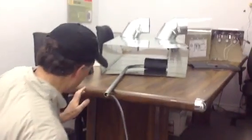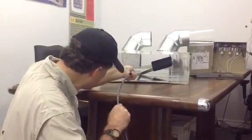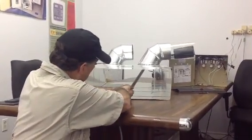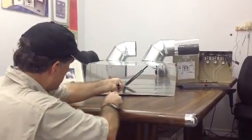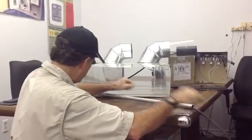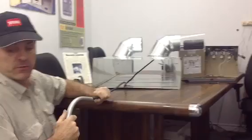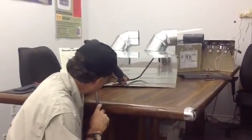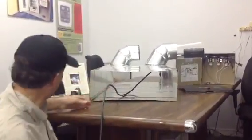Now I'm on a ladder, I'm looking through an access panel, I'm reaching down the duct. I take my tool, I get it up there as far as I can, and I just push. Now it's in there. I'm going to go ahead and push the excess tubing. Remember that piece of yellow tape — that's our marker tape. I know that it needs to be even with the mouth of the duct before I deploy the damper, and it is. It's about right where I want it.